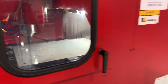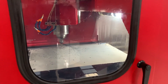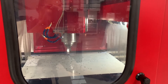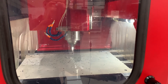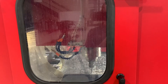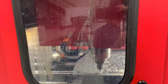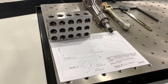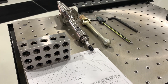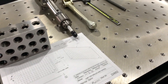Let's take a look at the drill. We drilled the four corners first, then used an end mill to ramp down and counterbore the four big corners. Now we're using that Mega Muscle drill where we set the tool length, going down at about 50 inches a minute through this steel drilling these holes. The machine is still hard at work — more than a couple hundred drilled and tapped holes, just breathing right through it. Here's our print, there's the part we're making — and here's the finished product: this handy work table, and this is the plate we're actually making.